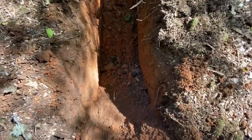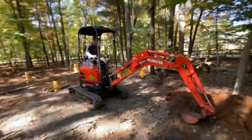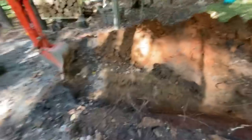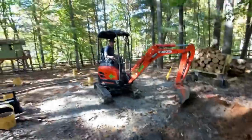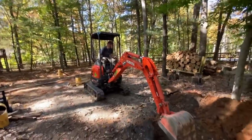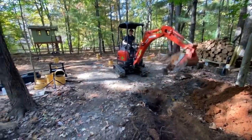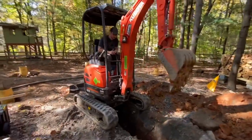We've got the utility ditch going here for the water line — two feet deep so it doesn't freeze. You may have to go way deeper than that in the north. Don't tell him I said this, but Johnny's pretty good on the excavator. We're going for 24 inches down and as you can see, it's bang on 24. He even thought about leaving a way for him to get out of here with the excavator when he's done — real man-of-genius type stuff for a guy that does woodworking.